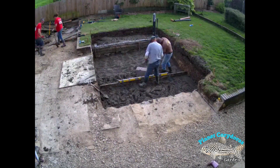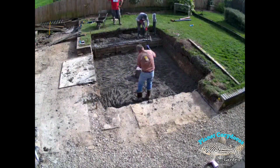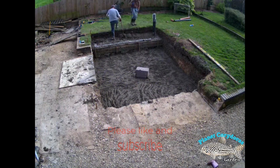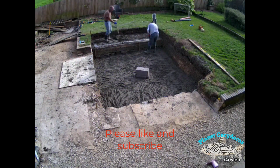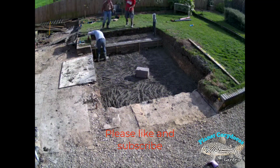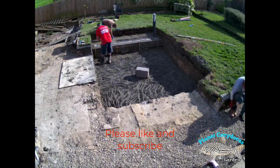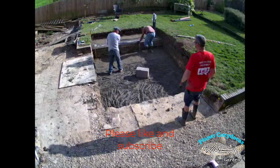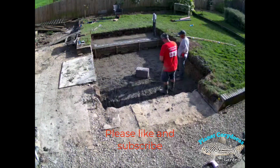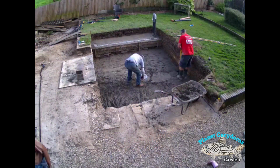So there's the biggest lesson for anyone pouring concrete in this way. You can ask for more water to go in, so it is a bit sloppier, so you can actually work to it. We were an hour over our allotted time, so we got charged extra. I think they gave us about 45 minutes to get it off the lorry, and we were an hour over getting it, and it was incredibly hard work. Here we're going around now with a whacker plate, trying to get some sort of flat level on it.